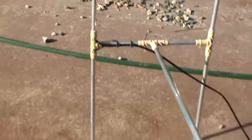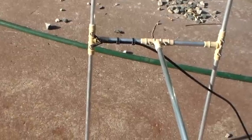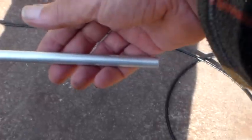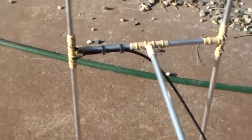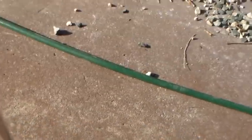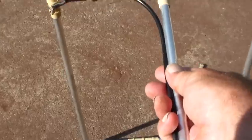It's a two metre antenna and this is going to stick out one side of the centre mounting. There will be a smaller one of these — about a third of the size — on the other end of the boom. I might make the boom a little bit longer and have them further apart, but they're individual antennas. So there will be a 70cm one on this end, a two metre one on that end. All that will happen is the coax goes from the feed point along the boom and it will go to a little diplexer, so there's only going to be one feeder going up to this pair of antennas.